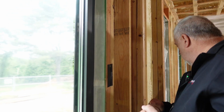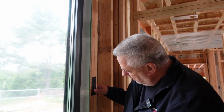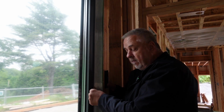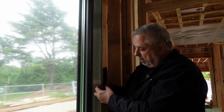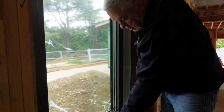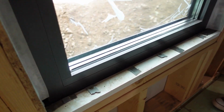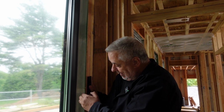Now, if you remember, I don't think we have one here where the clips are fully extended, but we have these bumps here. These are the installation clips from the Schuco windows. And typically they were out here at maybe about 1 inch to the opening. But the general contractor simply went around and basically cut them all back, and then by cutting them back, it allows for the tape to simply come over and just encase those clips in the outside of the air barrier.